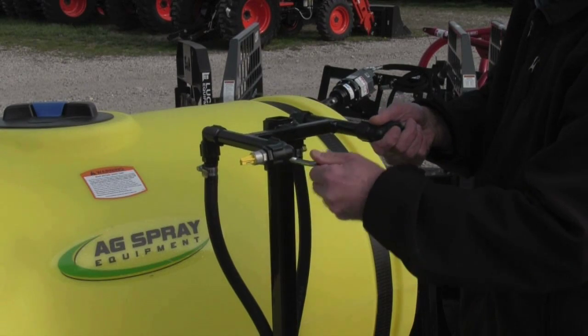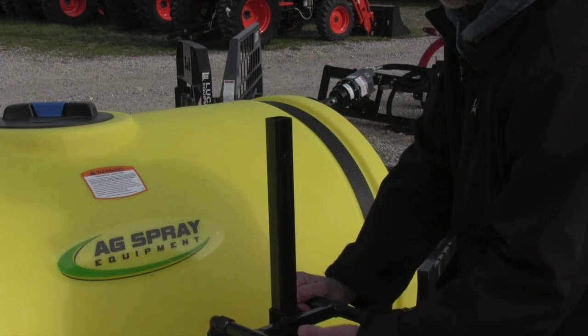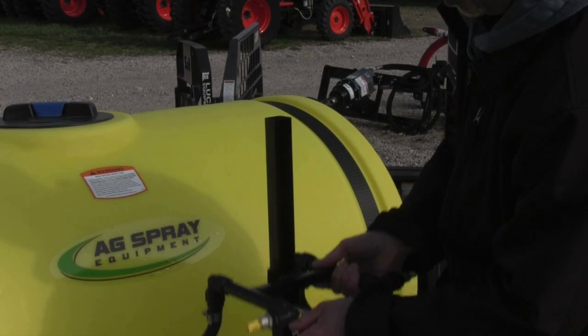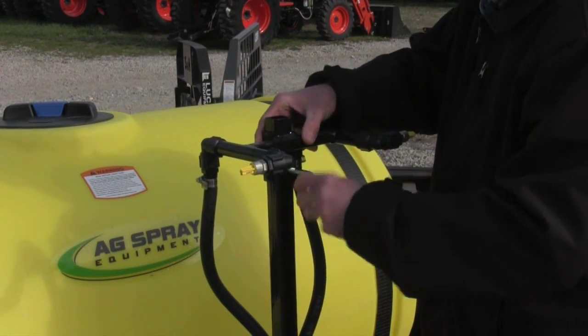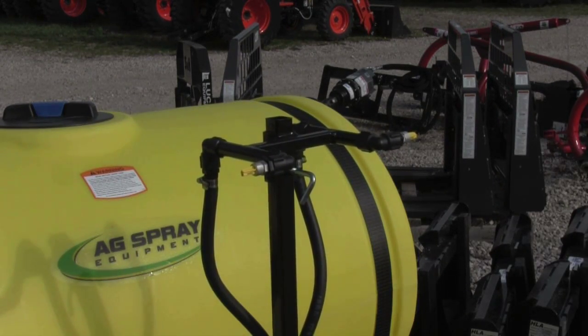Like I said, they're very forgiving in any types of areas. It's very important to understand your distance of throw — that's probably one of the most important things. Most boomless sprayers have an adjustment where you can go up and down a little bit. If you're on a windy day, you can pull that boomless apparatus down, which will help quite a bit, but it does bring down the distance you're going to throw your spray. At max height they're doing basically 17 foot on each side, 34 feet of coverage.